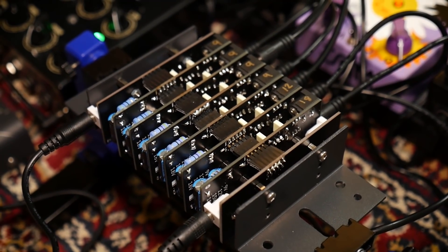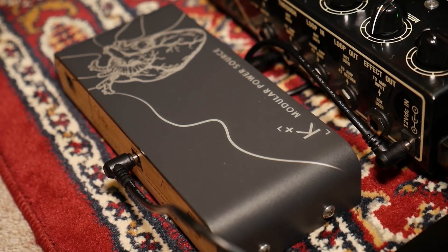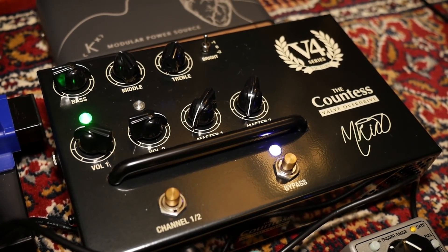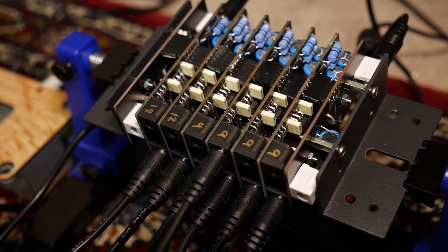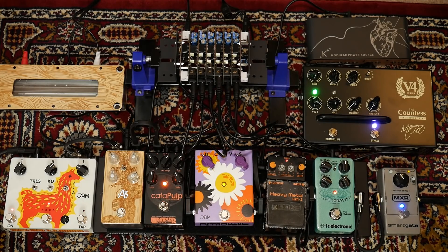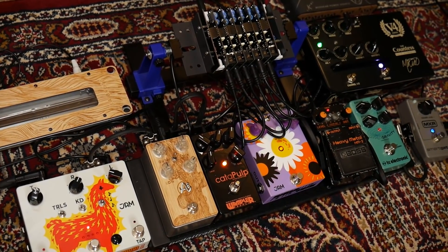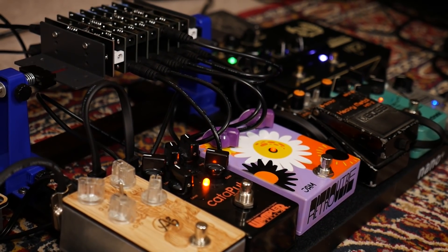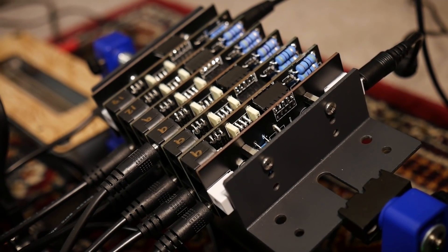You'll remember that we have a 24V throughboard here too. That is supplying power to the big K Plus power source which can deliver 12V at 2 amps, perfect for powering the Victory V4 Countess. This thing has several valves inside and requires a lot of current. Our DIY supply can't achieve that on its own, but it does power a second supply that can. While the Countess isn't in the signal chain here, it is receiving power from the same line. Even running all of these at once the effects chain is whisper quiet — absolutely no noise whatsoever on the power line, just the faint hiss of the HM2 noise floor. I didn't want to go overboard with this demonstration, keeping it instead to a usable signal chain, but even with all of this we aren't even scratching the surface of how much we could power.